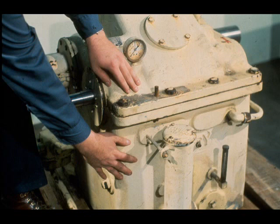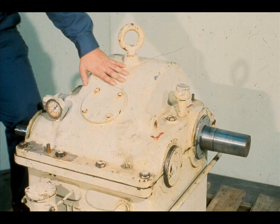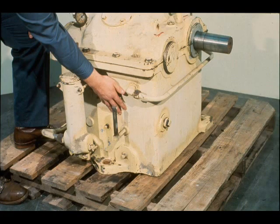The main component of the gearbox, as seen in this view, consists of the case itself. The case is generally split horizontally, as is being pointed out here, at the center line of the shafts. The upper half of the case acts as a cover for the gearbox internals. The lower half structurally supports the gearing within, and may, in some cases, act as a reservoir for the oil required in lubricating the moving parts of the gear.